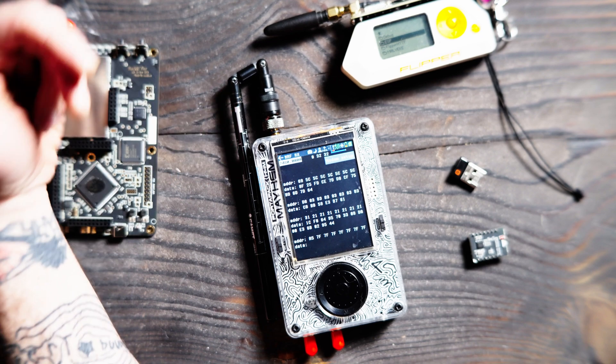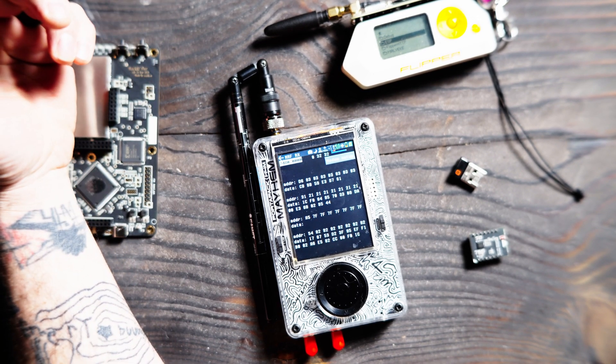Getting into NRF, this is the NRF decoder app. NRF is a proprietary low power and low cost transceiver that operates in the 2.4 GHz range, produced by Nordic Semiconductor. I'm getting all this off of the Mayhem documentation or the wiki, so you can follow along if you want to. It is often seen as NRF24L01, and they are cheap little transceivers. This app you can use in the Portapack to decode data sent from the NRF24 transceiver and see some data messages. It currently only supports the 250 KPS mode.